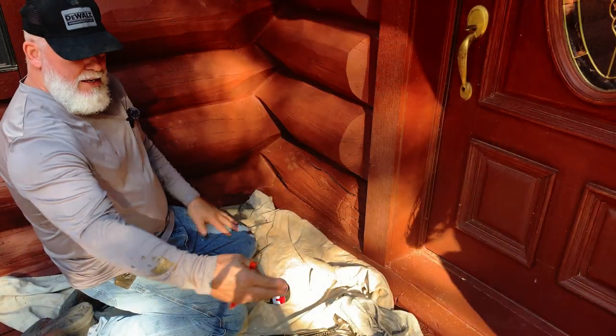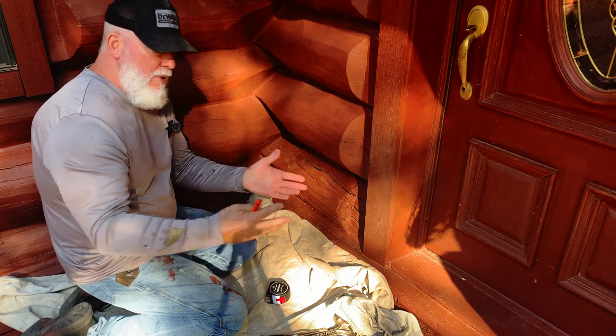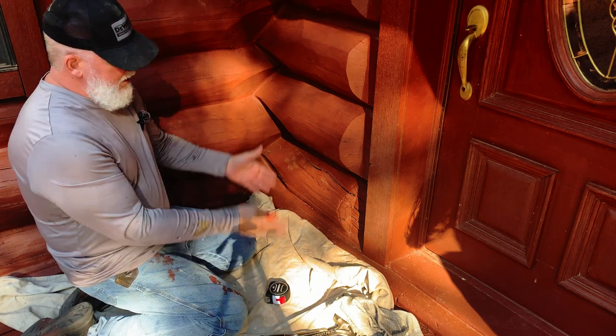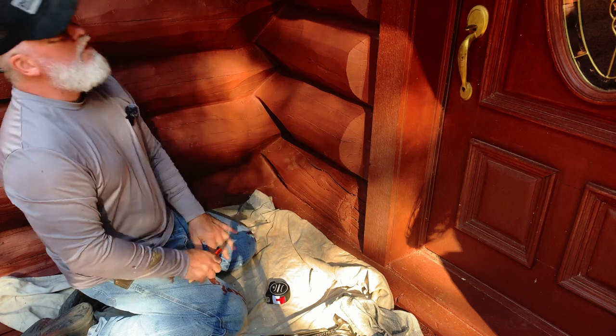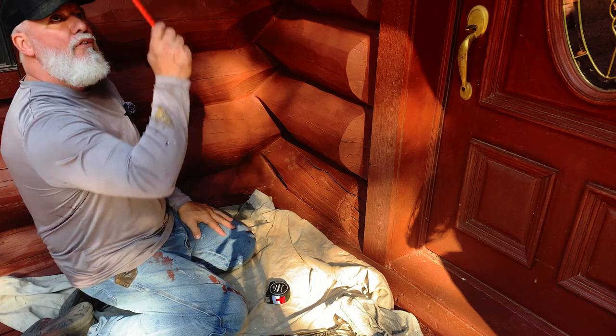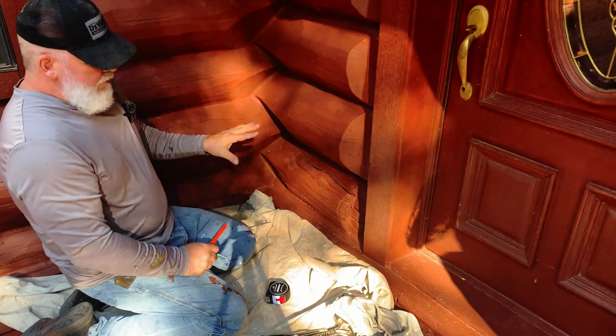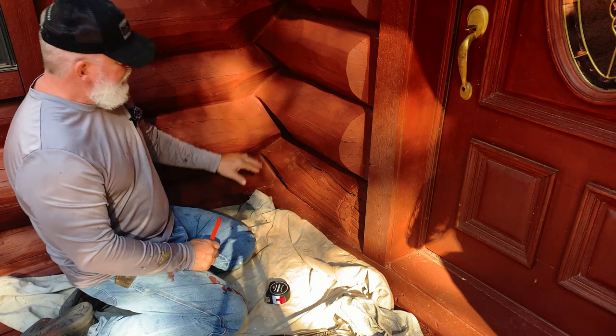So what I'm thinking is maybe when they're clearing the snow off in the winter, away from the doorway, they're throwing it up against the house here, and it's worked its way down through these cracks because it's very covered. You've got probably a 4 foot overhang up above here. Or when the snow comes, it's drifting and it's just building up in this corner.